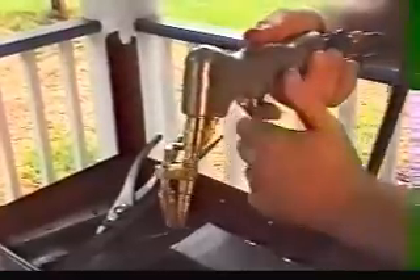We use the over cutter. The sheet metal cutter was the under cutter, and that's the one that you pushed. The over cutter, however, you pull. The oxygen tip is now the copper tip. We're using the copper and the number two tip. The copper tip should be between one-sixteenth and one-eighth of an inch up off of the metal.